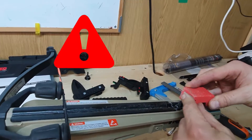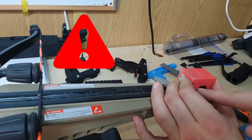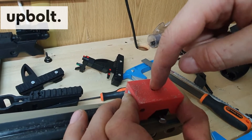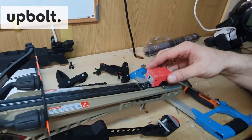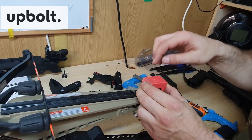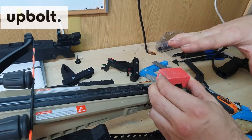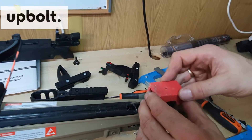Just to mention again: when making holes, make sure that as you prime the first two millimeters you leave the plastic item in place, because otherwise you might migrate the drill and your hole will be in the wrong position — and that will be a big problem. In the next video I will also show you how to make a correction if you drill the hole in the wrong place, and what you can do to eliminate the hole and make it in the right position.